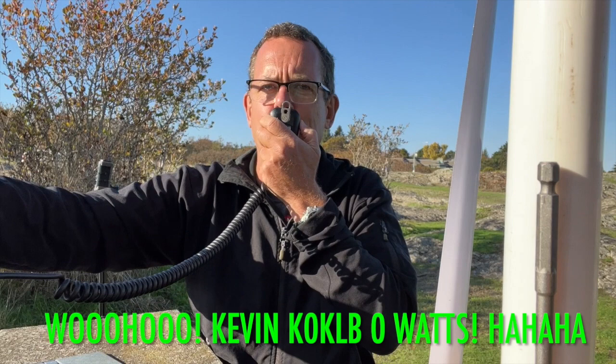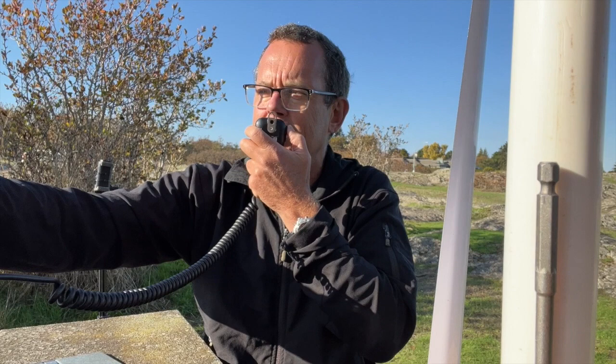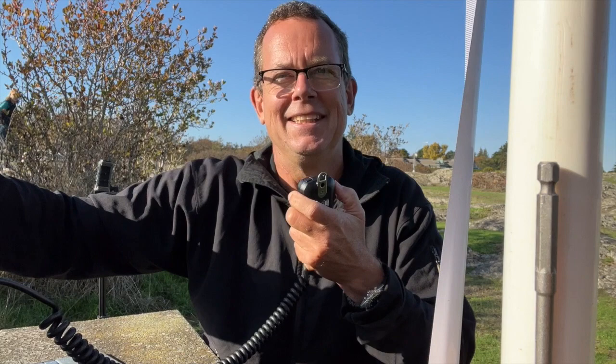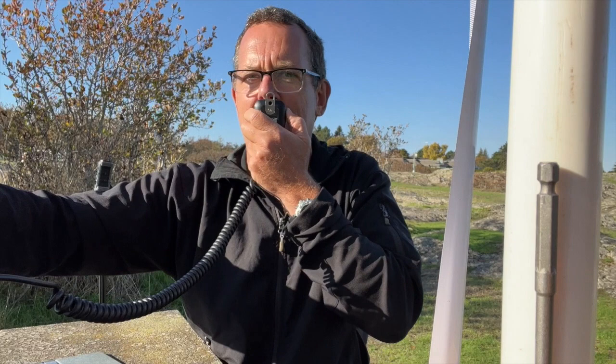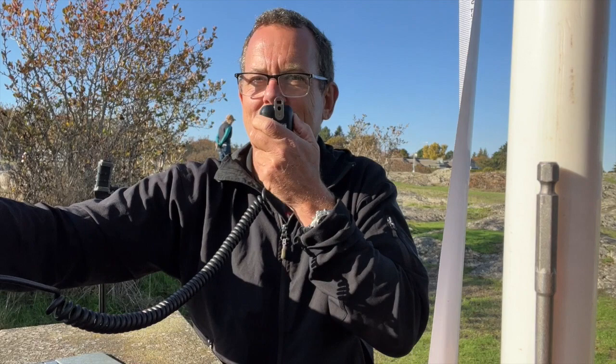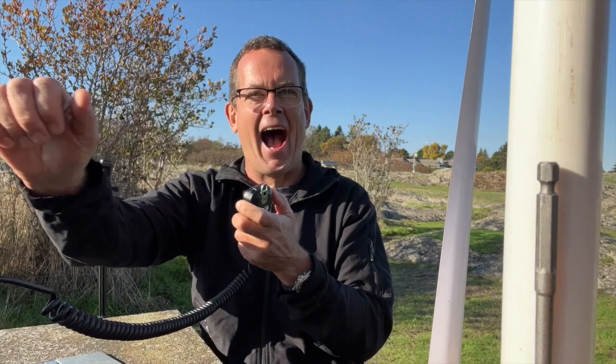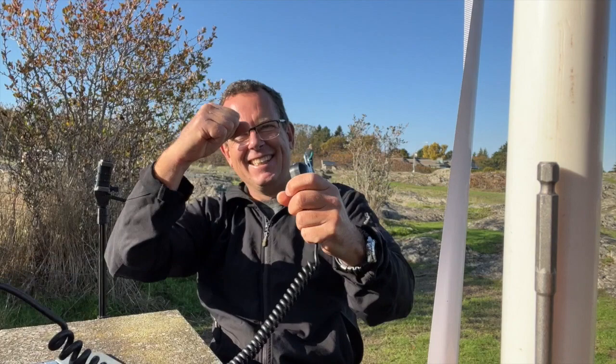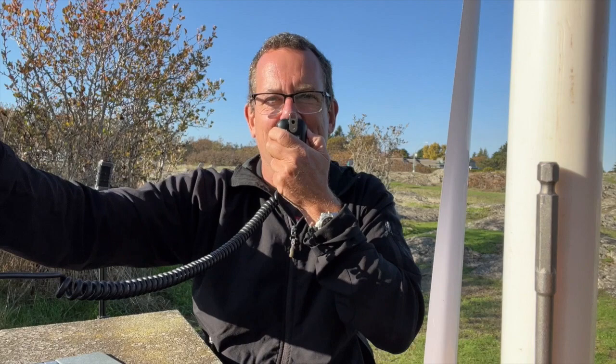Well, I'm filming this. Kevin's on zero percent - that's about 650 milliwatts. Kevin, I'm at 50 watts. Good copy on 50 watts. Now I'm on 10 watts on the tape measure - do you copy? Yeah, about 10. I bumped up to 5 watts for you, so your 10 watts is about an S4 on this end. I got good clear audio. Kevin, you're going to be on my next video front and center buddy. Now I'm at five watts on the tape measure - copy? Good copy on the five watts. Now I'm on one watt, Kevin - one watt. I got one watt, I heard every word of your audio. Drum roll - Kevin, I'm on zero. Zero watts on the tape measure - do you copy? Copy every word, no problem, just down above my noise but I heard every word. Kevin, you know that I'm doing the happy dance, the woo-hoos, and it's all on the video buddy - you're going to be front and center, brother.